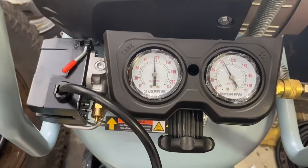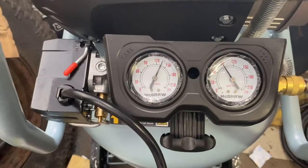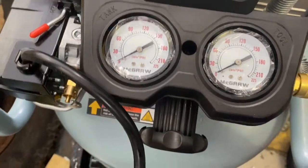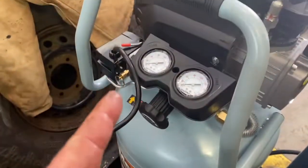The tank kicked on at 100 and it should kick off at 135–140. There you go — 135. Gauge reads 135, box says 135. It's back down to zero — you can hear it finishing the drain out now. When you're not using it, leave the drain open; close it when you use it and it'll build the pressure back up. Well, that's it for today. I've got an air compressor — wanted one for years, finally got it. Setup was really simple. It seems to come up right to the pressure on the box. That gauge said 135, that says 135. Now we can use air tools to fix things. See you next time.